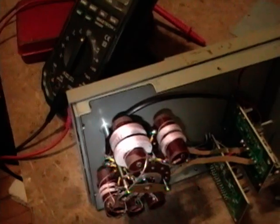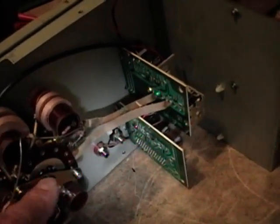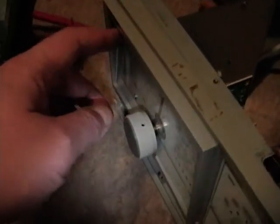Here it is on the inside. It's actually not all that different from its tube equivalent — if I pop open the Heathkit or RCA you'll see something very similar in terms of a band switch and a bunch of inductors around a multi-position rotary switch. Of course the big difference here is these solid-state components over here and a solid-state power supply. Nothing looks to be fried that I can see. Here's where the damage is on the inside — this whole plastic frame is held onto the metal frame by Phillips screws. This side broke out, this side is still attached, so I'm going to remove these screws, take the plastic off, and free up that mushed-in clear plastic. Then I'll try powering it up.